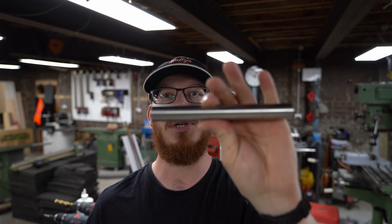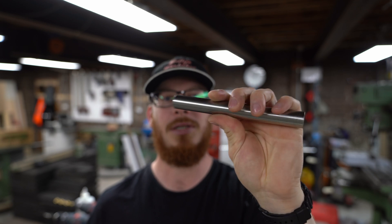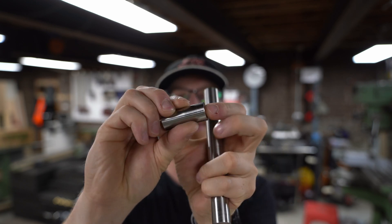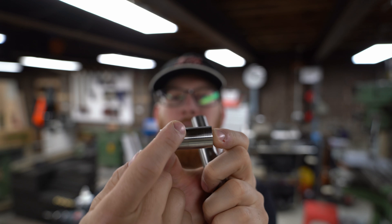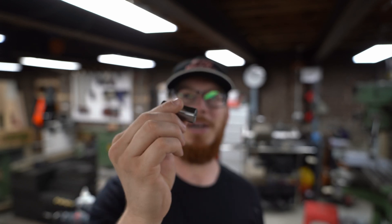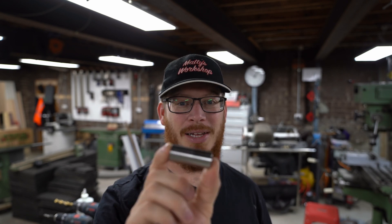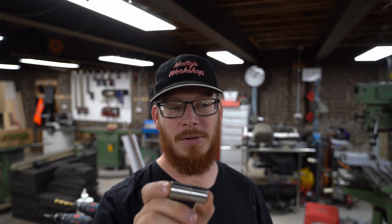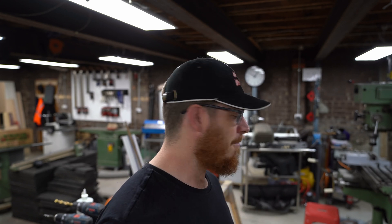It's morning now, it is 10:02 and I'm just getting started. I got this machined yesterday. This is the central spar that replaces the middle of the body, and I've come from both ends with this so you can see there's a slight mismatch in the very middle, but that's okay — this is drilled and reamed. I may already have stuffed up because this is 46mm to 47mm and I need two pieces of 22mm. I thought it was 20mm when I cut this off and I thought that left me plenty, but I've got very little material to bandsaw and face off, so we'll have to go very carefully.